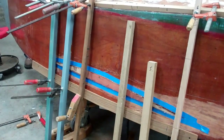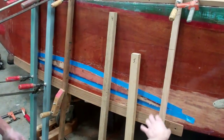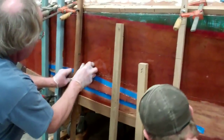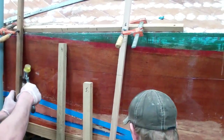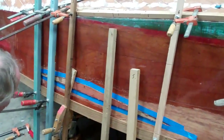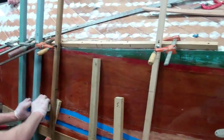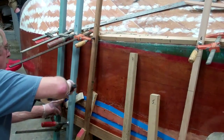You can see what John's done here: he attached a strip of wood along the very edge of the gunwale and another one into the bottom of the boat where the extra screw hole will be filled and hidden. The holes created in the bottom of the boat will be filled with 3M premium marine epoxy — a fairing compound.